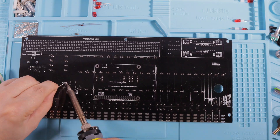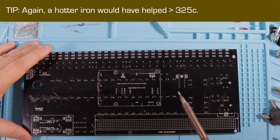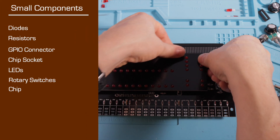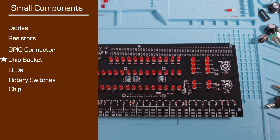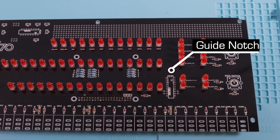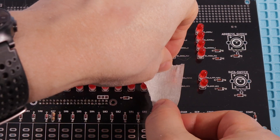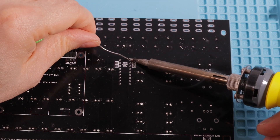Now looking at my work, I'm still a little worried about having to go over things a second time — I'm not usually that hopeless with an iron. Flip it all back over. Since I didn't put the chip socket on first, I now need to take the LED cover off again. There's a guide notch on the part — you want that to match up with the silk screen outline as you place it. The notch should be on the upside. Time for a little more masking tape. Like the header, you want to start by tacking this in place, so make sure everything's square.